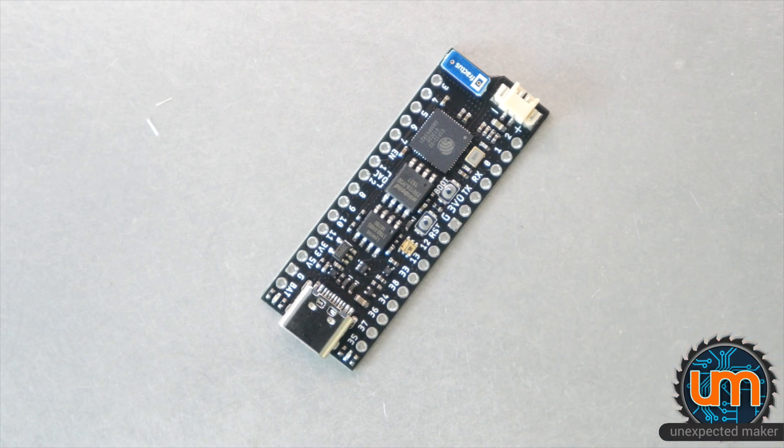And there it is. It's a bit warm, just let it cool down before I handle it. Everything looks to have reflowed correctly, but I need to give it a peek under the microscope just to confirm that there are no shorts and everything is on their pads.